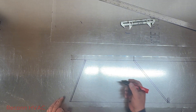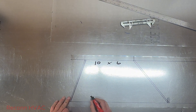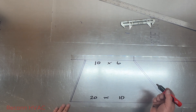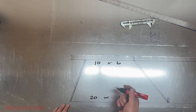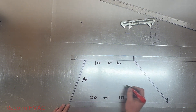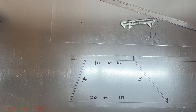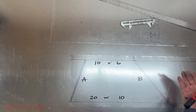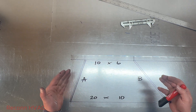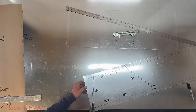This is our top and this is 10, this is 6, and this is 20 because we're looking at 20 and 10. A lot of times if I'm working in a shop with a bunch of guys — somebody's on a Pittsburgh and somebody's on a brake doing production — I'll put letters on the sides so whoever is assembling or bending can take that next piece, put it on there, make the angle bends, put the cleats on, and whoever's putting it together knows what side went with what. There's no confusion that way.